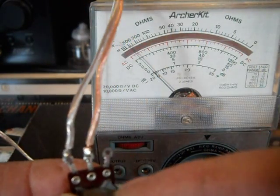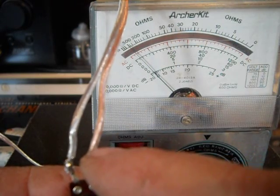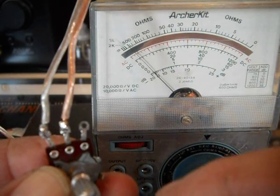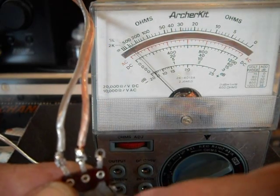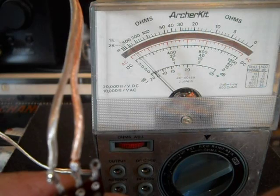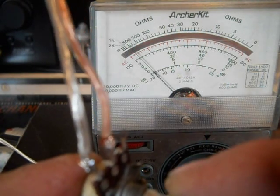You can change which direction you want it to turn. If I would have had this wire over here — which is the ground I just used for purposes, that's the copper color — if I'd had it over here, it would have worked the opposite way. Instead of going up to make it louder, it would go down. If you put one of these on something — I've used them on speakers, external speakers, so I don't have to reach for the radio, I can just control the speaker. You've got to be careful; it depends on how much power you're putting out of a radio.